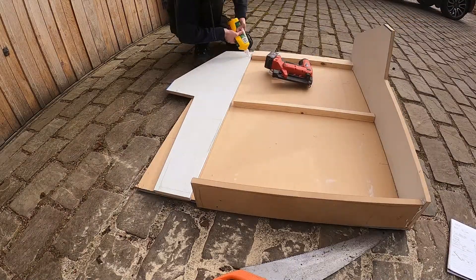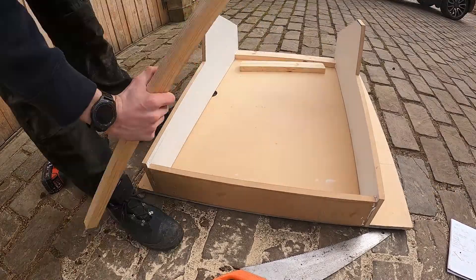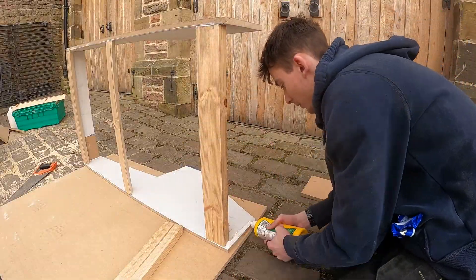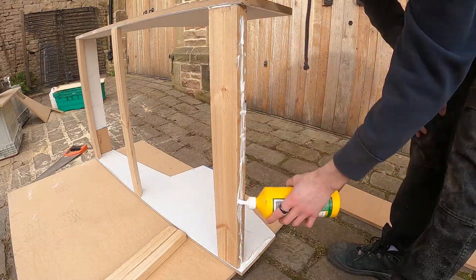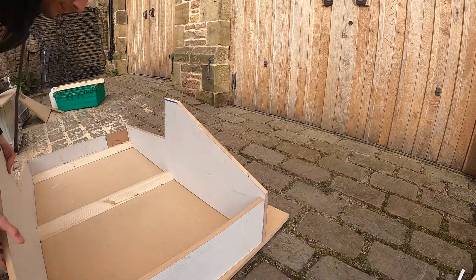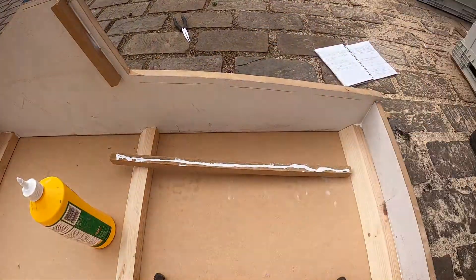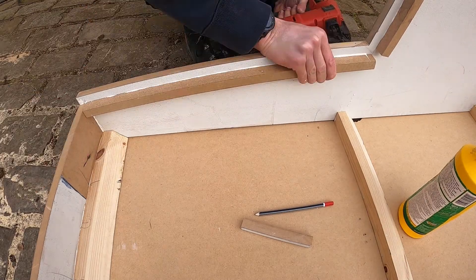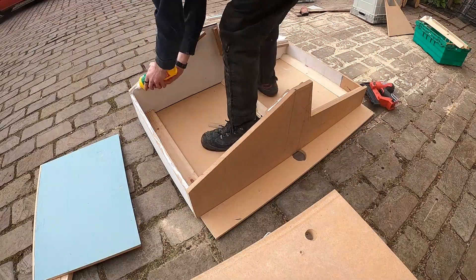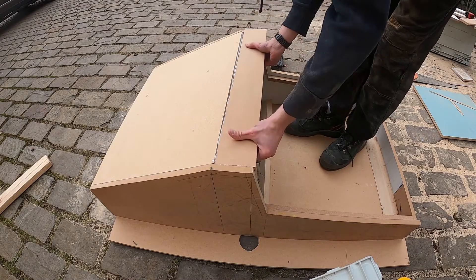I used plenty of glue and brad nails throughout just to make sure that everything was completely solid. I also used some spacers just to make sure that very middle piece was completely parallel. Here I'm creating — I guess you could call them tabs. I don't know if there's a proper word for these, but these are basically just going to be used to hold the rest of the panels in place. It gives me something to actually mount to. You can see I can tack them in with the brad nails and I can do the exact same when I come to put a panel on those areas. It just gives me a place for that panel to rest on while the glue dries — it doesn't put too much strain on the nails that way.